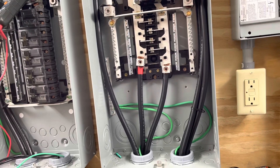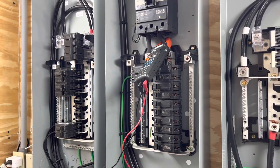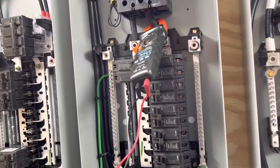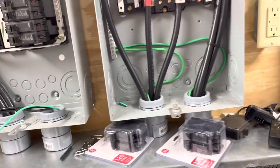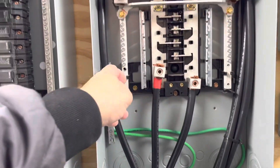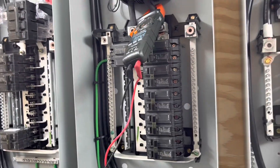So I've got to rewire the panels. I thought about taking this panel out — I may leave this panel and just take this one out here. I think the wiring is going to work out. This wire runs in here; it'll be long enough to come back out and then over into here to go to the transfer switch. I will have to run a neutral, and I think this neutral wire here will be long enough that I can pull it back in here and connect it to this neutral bar.